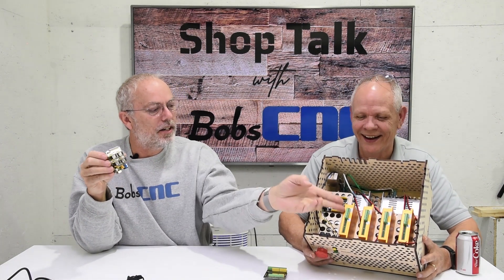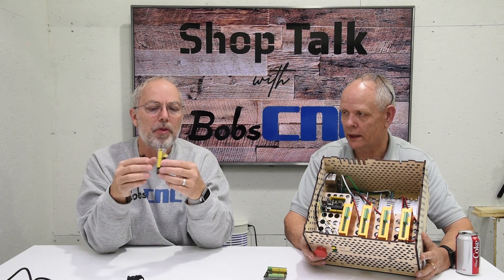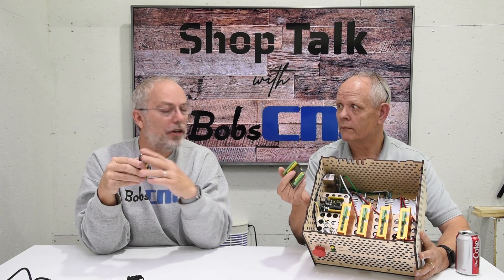The really cool thing about the E3 and the E4 is that everything comes apart and there's no real wires except for connecting it. The microprocessor here is an Arduino Uno type — we like the Keyestudio. We use a middle board as a shield, and what that shield does is tie all of those Arduino pins to the shield that sends them to the driver. For the KL7 series, we're wiring the drivers directly to a screw shield, so you'll hook up all your step and direction signals plus the alarm and the power. On the E3 and E4, all of that is done for you through the shield.